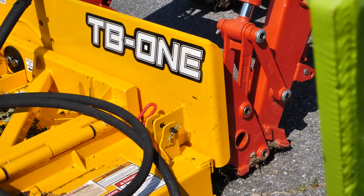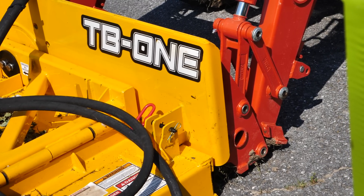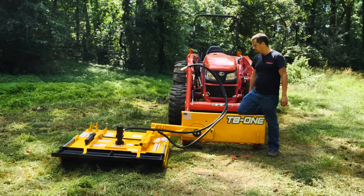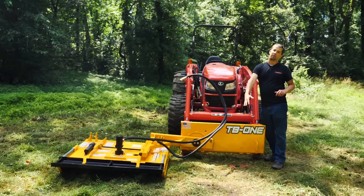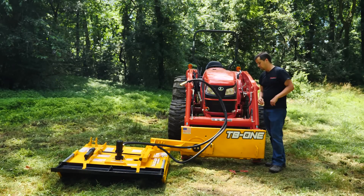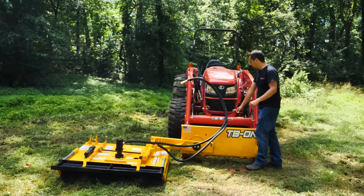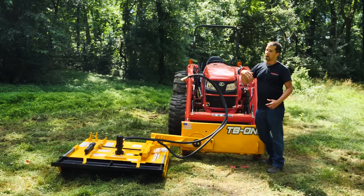It's definitely a piece I would not give to a novice operator — I would really not let my kids run it. On skid steers, they typically attach a chain to the backside of the mower that connects to the skid loader to keep you from lifting that thing too high in the air. That little piece of safety equipment is not on any of these mowers I've seen to this point, but it would be very easy to put one on yourself. Just grab a short length of chain, go through one of the open holes in the back of the skid steer quick attach, and chain it onto the front of your grill guard — that would keep somebody from taking this thing and lifting it way up in the air where it really shouldn't be.